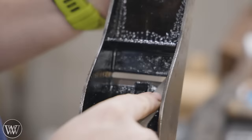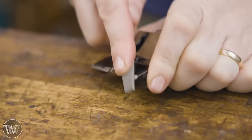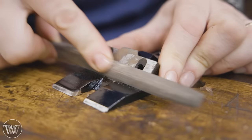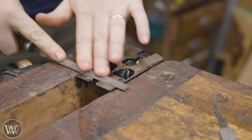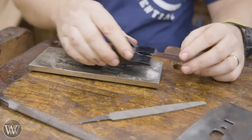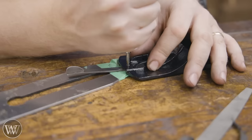For any of these solid surfaces, I'm going to come in with a very fine file and clean off any Japanning that might stick on or any crud, and take them back to just about there. For the frog, there was some buildup and I'm going to hit a lot of it with the file, but then I realized there was quite a bit of out-of-flat. Since I don't have a lateral adjuster on, it makes it really easy — I can just take it over to my coarse stone and spin it around and get a nice clean surface.